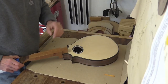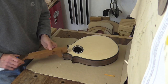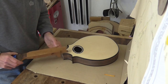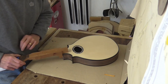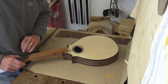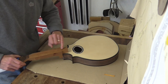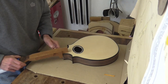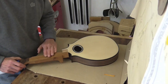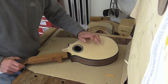You can see that the tenon has been roughly cut, and in front of me I've got a couple of hours of chiselling and filing to make sure that it fits absolutely spot on. Of course, what I've got to do whilst doing that is check for the alignment — the centre line running right the way down the instrument — and also make sure that once the neck is in its final place, the pitch of it is correct to give you the right height of the bridge.